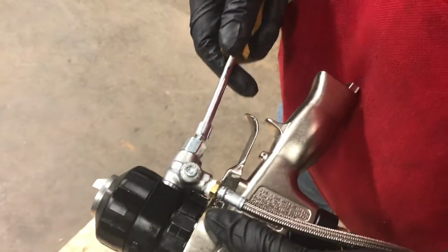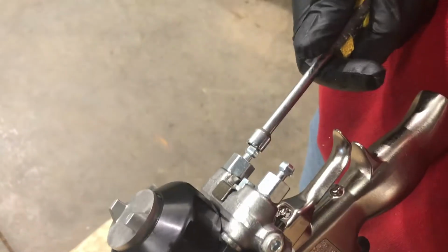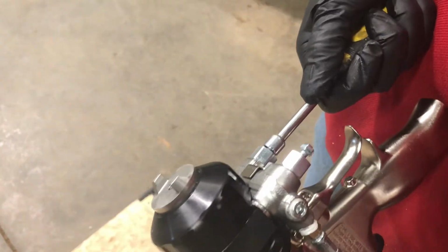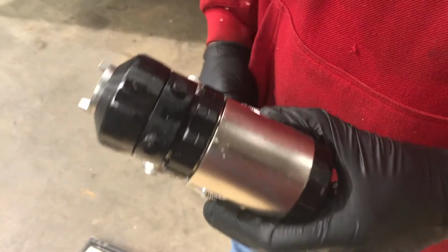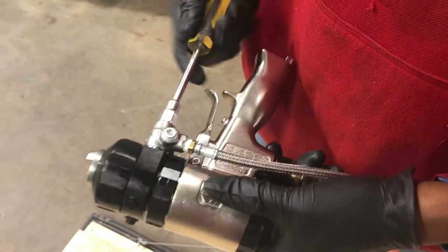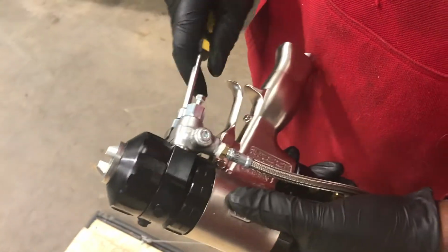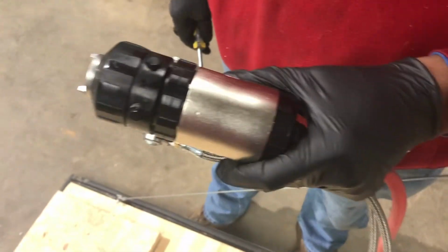But we're going to go ahead and just crack these valves super quick. Open and shut them. Boom, boom. There you go. Make sure we don't have any leaks. Boom, boom. And my theory is, I'd rather have that thing in the off position before my brain figures out that it's leaking. So that's just an exercise that I do there. Now we can go ahead and open them. It's about 3 turns. You do not have to He-Man these. 1, 2, 3. Now they are wide open.